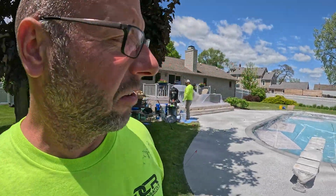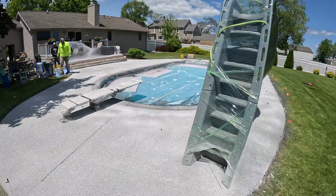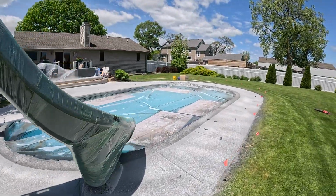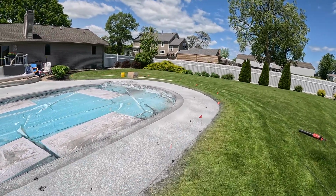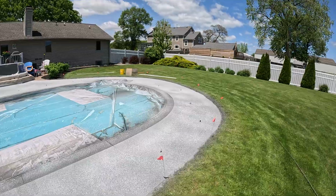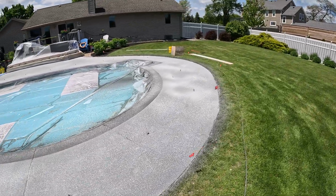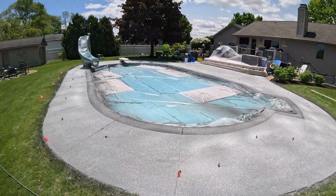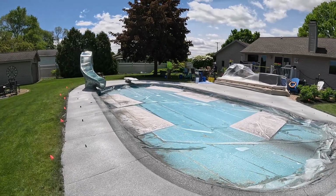Turned out to be fairly decent, minus a little wind. So we have our border done. We have all of our base coats sprayed down on the deck, and we've done spray coat 1 on the deck. So the base was basically a light gray. The spray coat 1 is almost like the white that you're seeing. And now we'll be on to spray coat 2, which will be basically the same light gray again. And then we have 2 coats after that, 2 splatter coats.